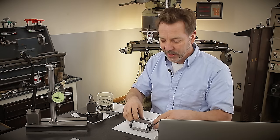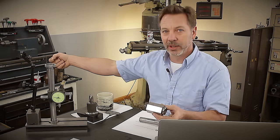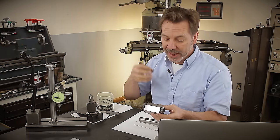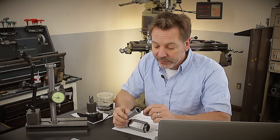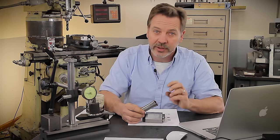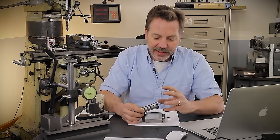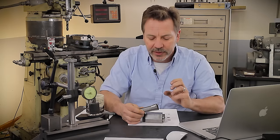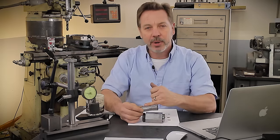The disadvantage to the bolt is it doesn't have a through hole. Sometimes I'm working on these collet blocks with a piece of steel that goes through and is several feet long — and that is the advantage of using a 5C collet. The other challenge with an R8 collet is you're limited in sizes. A general set of R8 collets only covers about 13 sizes: 16ths, 8ths, 3/16ths, etc. — and that's sometimes just not enough sizes to really clamp down.